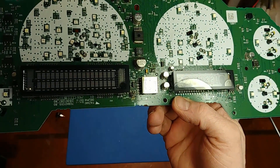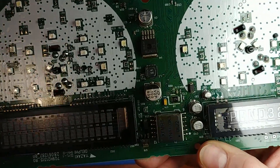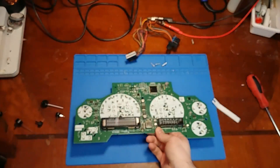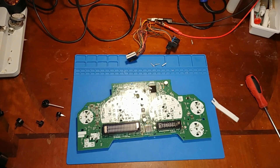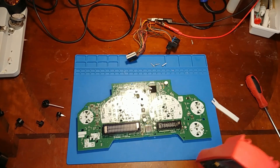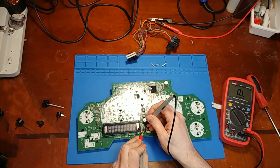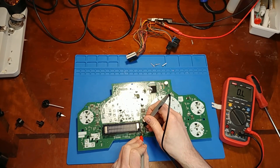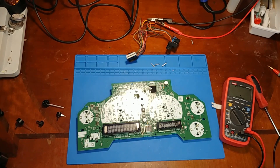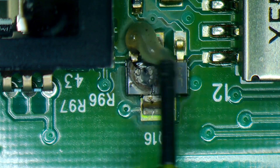White means oxygen has gotten inside the display and they're no good anymore. I think what I'm going to do is replace the MOSFET, but first I'll make sure the 100-ohm resistor that goes to the gate is still healthy. It looks okay — yeah, it's still 100 ohms. I think we'll just have a straightforward MOSFET replacement here. Let's switch over to the microscope.